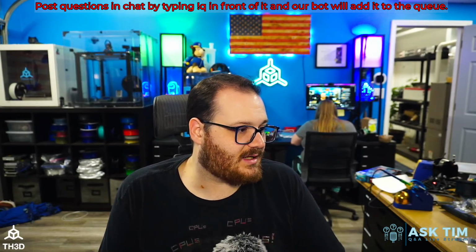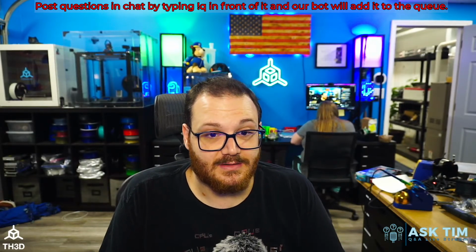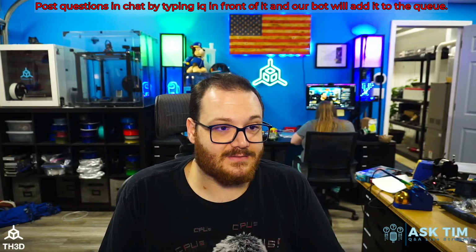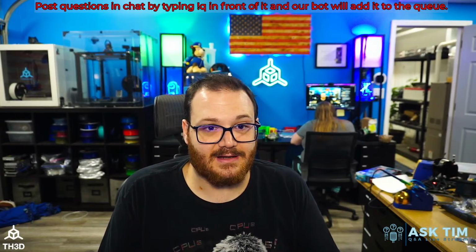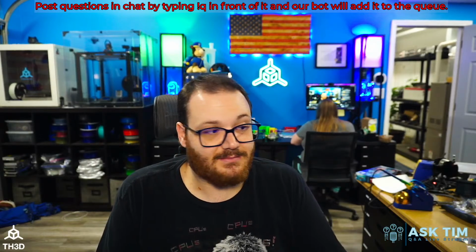Jay Moore asks, can you print ABS without an enclosure? I'm going to tell you no. Yes, you can, but it doesn't work. Anybody who tells you otherwise either lives in the Sahara Desert where it's insanely hot, or they're printing small stuff and got lucky, or the filament they're printing with isn't actually ABS.